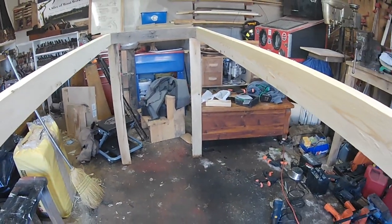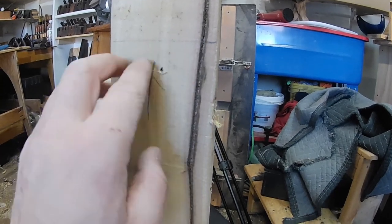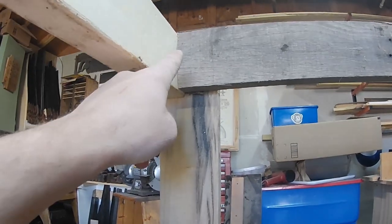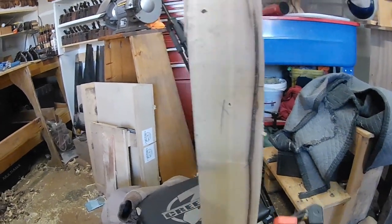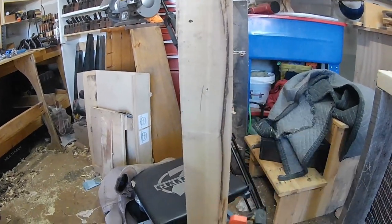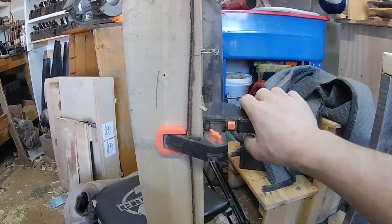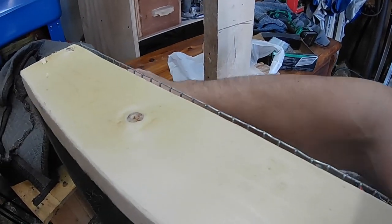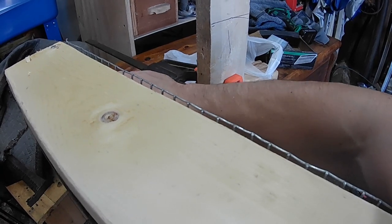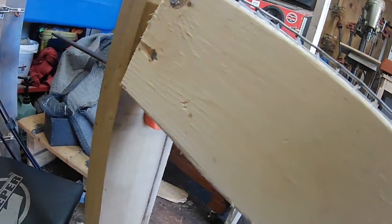You can see I got a mark right here with an X, helping me know that this is the very top of the floor. The floor has got to be down here and I measured 18 inches off the top of the leg coming down. What I'll do now is take a clamp and squeeze it onto this leg and the other one, then I'll be able to put this up on top of them so it can just rest on that end while I get the other end tacked in place.